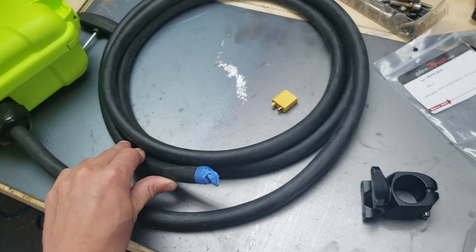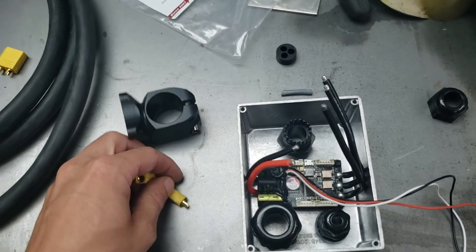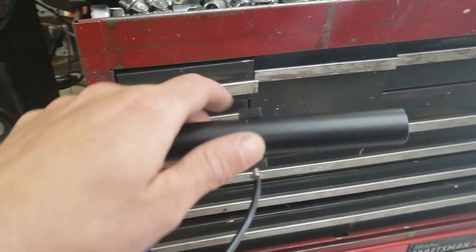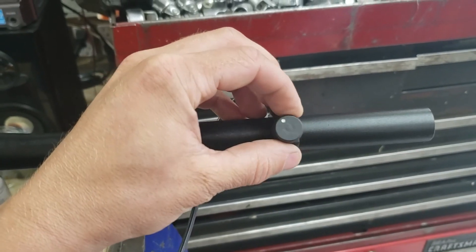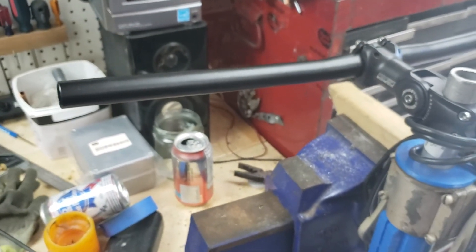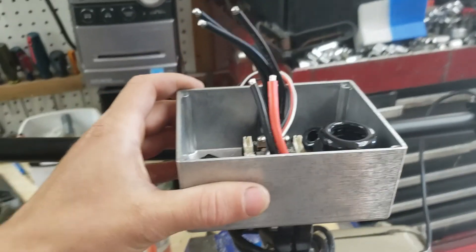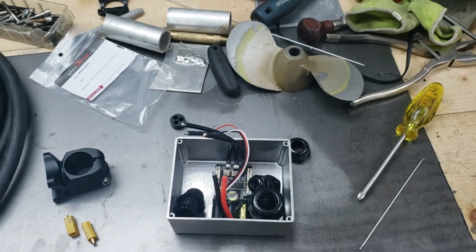They'll come through here and connect. For now I'm just going to use these XT90 connectors split in half — two barrel connectors coming in through the big gland. This little gland is for the handlebar controls, which for now is just going to be a little waterproof potentiometer for testing. I'm going to add a kill switch as well — a marine style red pull kill switch. Once this is all wired, the electronics box is going to live on top here using a bar clamp to secure it. I've got a bit of fabrication to do still but getting pretty close — hopefully running today or tomorrow.